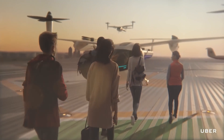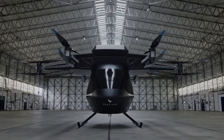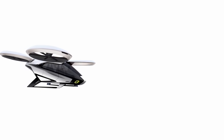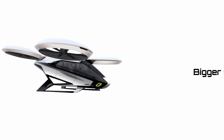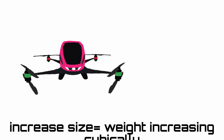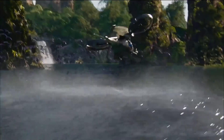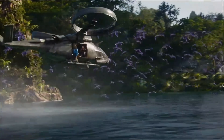We will first look at size and capacity. Size, empty weight and payload capacity are all limited by the energy density of the battery. A bigger size or a higher payload capacity in eVTOL would require a more voluminous aircraft, which would mean not just more weight, but much more weight. As the aircraft scale is increased, the weight increases cubically — if we double the size of the aircraft, we increase its weight by 8 times. We can indeed make a larger battery-powered aircraft, but it wouldn't be able to go the distance.